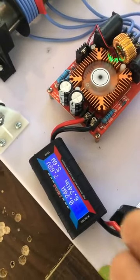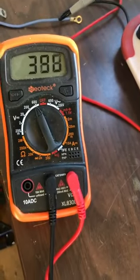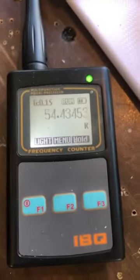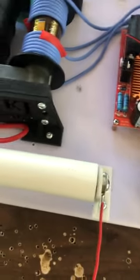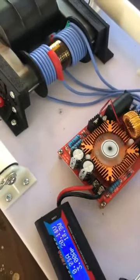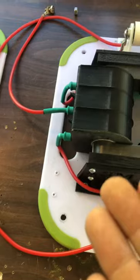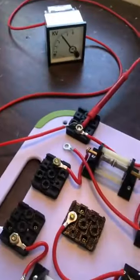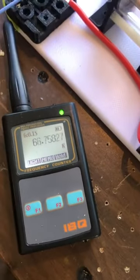It increases to like 21 watts — I saw 20.5 watts. As that increases, the charge in the capacitor builds and the output voltage builds for the inverter. The frequency is running around 48 to 58 kilohertz. It starts chattering a bit — in my opinion that's the earth energy entering the system. I think that's feedback coming up the ground wires. The capacitor is still building in charge and as it builds, the frequency is also building.